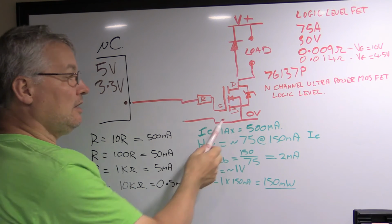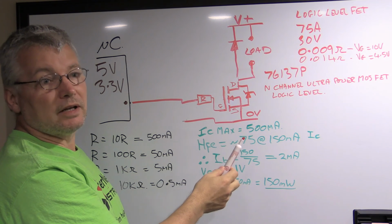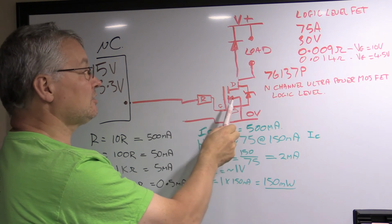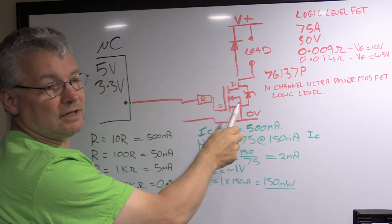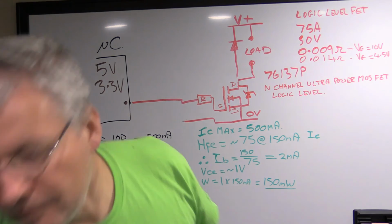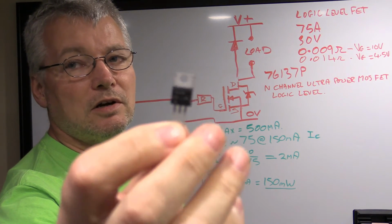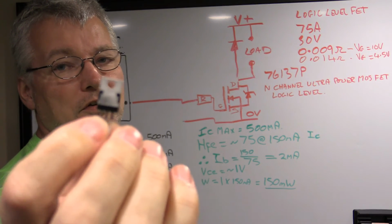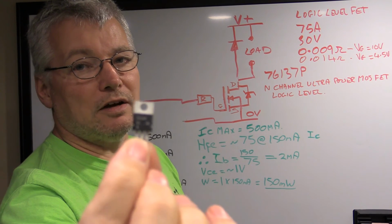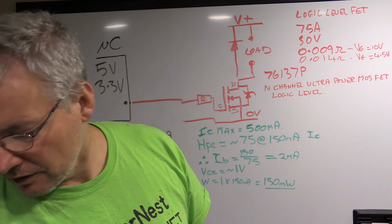So that's going to give you a huge amount of current carrying capability with very, very little circuitry. I mean, it's a single transistor. It's in a TO220 package, the one I use. In fact, I've got one here. One second. All right, there it is right there. That's all it is, one of those. And you don't even need a heatsink if you're using it in its switch mode, even up to about 10 amps. You just put that on your board, make sure you've got thick enough traces, but you do not need even a heatsink for it.